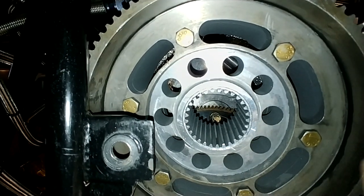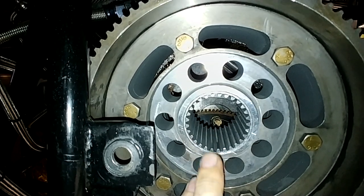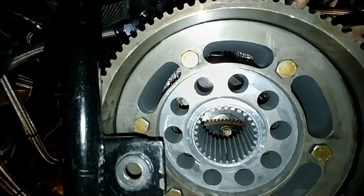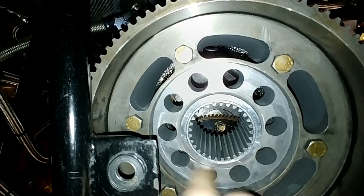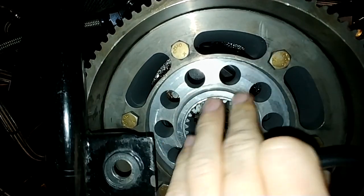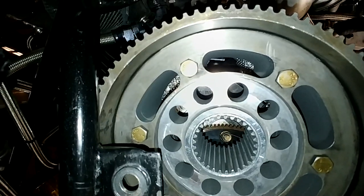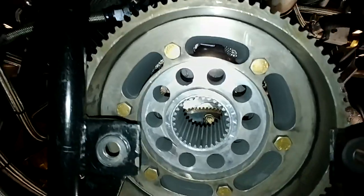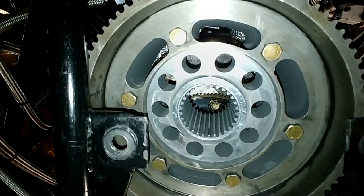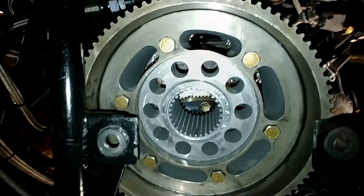And with the new spring tensioner on the belts there, that should have everything working back to normal. And worst case scenario, if it doesn't work fine, I can still run this for a while. It won't be ideal, but obviously I've been running it up till now. But what I'll end up doing is getting this inside boss here remachined, a new one made, and later on swap it out. But it's not going to slow me down, because this one is still serviceable. It's not going to fail or anything like that, but it'd be nice to have it nice and snug so it's not moving around. Anyway, that's probably the biggest problem with this, and we'll see when I get this spacer back from the machine shop, get it all snugged up there and see how it all works.